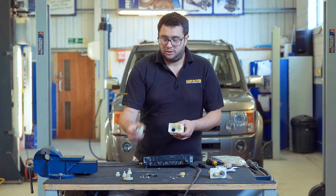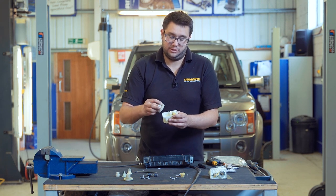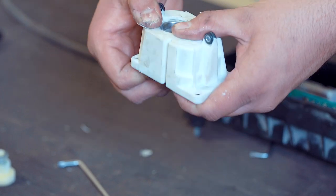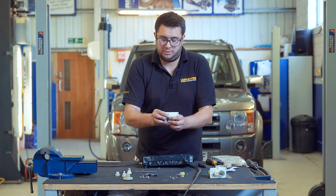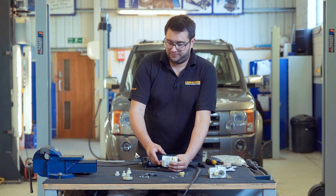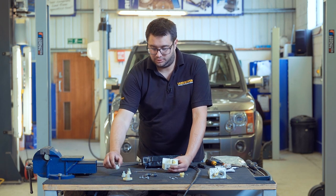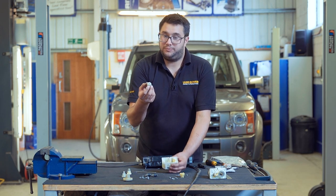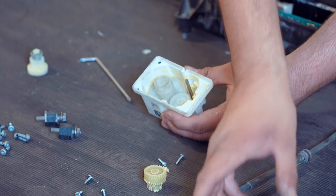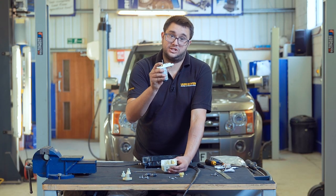Reapply a bit of grease before you build the new gears into the casing. When you go to build the new gears in, the first one you're going to fit is the large one, which is an interference fit in the big bearing in the back of the housing — push that one in. Have a look at this side to make sure it's going into the bearing squarely. It will push all the way home; make sure when it's in place that it turns smoothly. The next gear to fit is this small gear, which just sits into place in the corner. The pin that the gear spins on stays on this half of the gearbox housing, so it will just float around until you go to refit the plate.